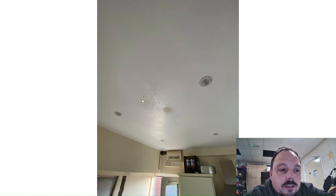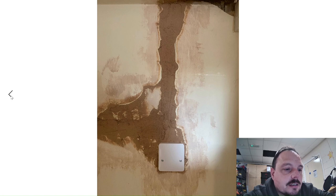There is quite extensive cracking on the ceiling, which is why the customer's having it re-plastered. There's a lot of pipework getting chased in as well, so it's all being tidied up by the plasterers. You can see Matthew's first coat of bonding gone in — it's always a rough mix to start with, just to get some nice, sound, solid covering in the chase, then you can get a finish fill on top. It's not worth worrying too much about this other than making sure it's reasonably flat and level and that you've keyed it so you can get a good finish coat on top.